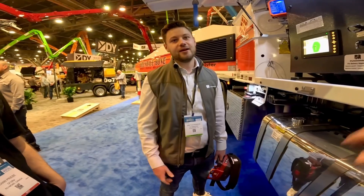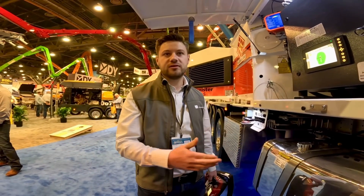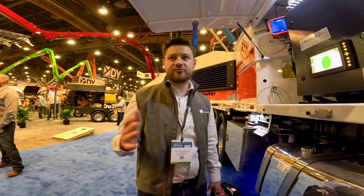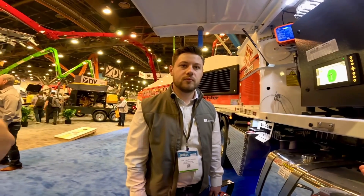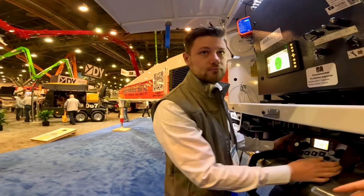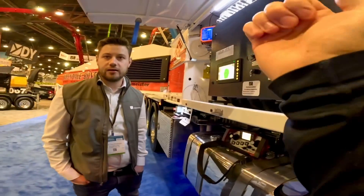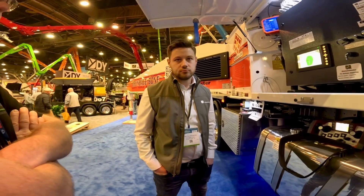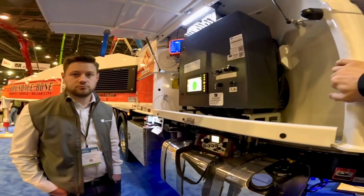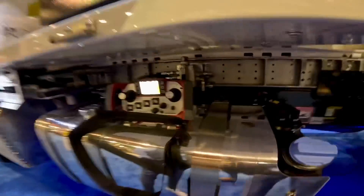If you have a tight spot with a large pump you can still get it done, and you'd even have more reach with the bigger pump in a smaller space than the smaller machine fully rigged. A 47 set up on the same outrigger footprint as a 38 fully rigged actually nets as much reach as a 42 - because of all that counterweight. For companies with fleets trying to balance schedules, having these options is a complete game-changer for scheduling and dispatching.